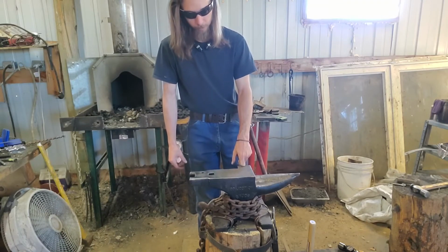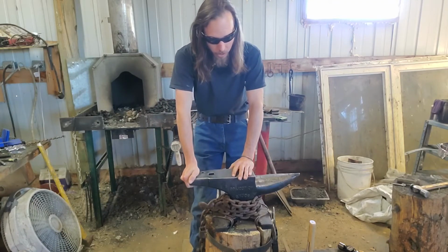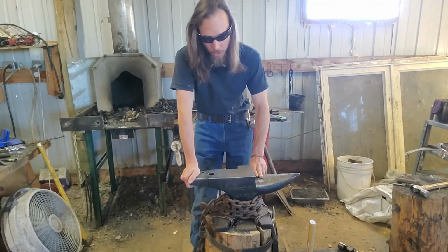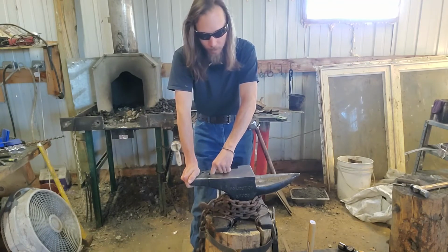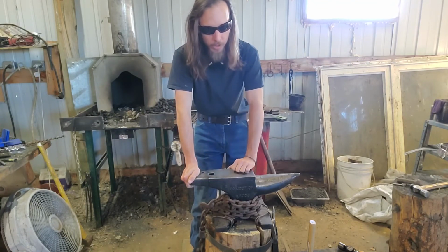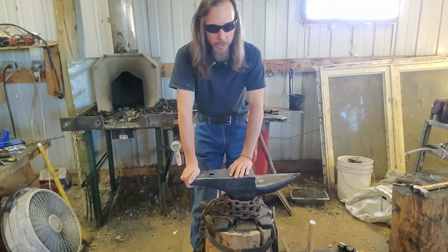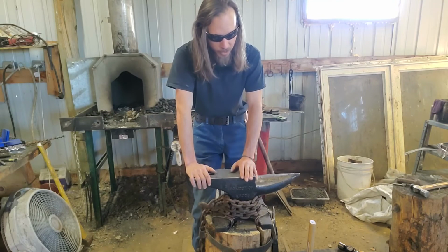I really enjoy it. Now, for the downsides of this anvil, I would have to say the only downsides are the lack of a cutting shelf, which would be very nice to see them add into this anvil's casting, the hardy hole not being squared up very well, and the pritchel hole not being very even. So those are really my only 3 complaints about this anvil. Aside from that, it is very good. I'm very happy with it after 6, almost 7 months of working with it.